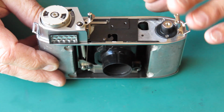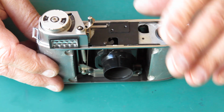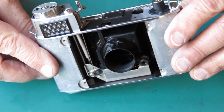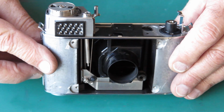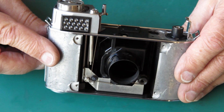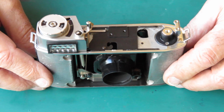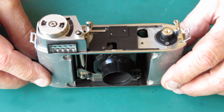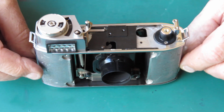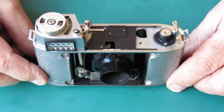The reason I'm leery about putting the rangefinder on early is if I've got the camera top open. That's a lot of shiny mirrored glass that I could easily stick my big greasy fingers on while I'm fighting trying to get the front of the camera in place, and I'd rather not risk that, because the semi-silvered, or the front surfaced silvered mirror in particular, if you get that dirty it's exceptionally hard to get it clean again without damaging it. Virtually impossible.